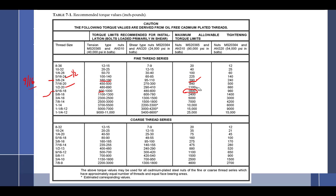What do you think that does to the threads inside of the crankshaft? Well, if they don't catch it and they put it together and it somehow manages to hold together, that bolt's going to fail shortly, and that's the one bolt holding one gear on that drives the whole drivetrain. So that gear is going to fall off and the whole engine is going to stop. Or it's going to damage the crankshaft. It'll strip out the inside of the crankshaft.